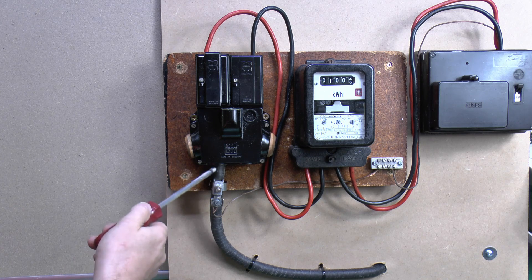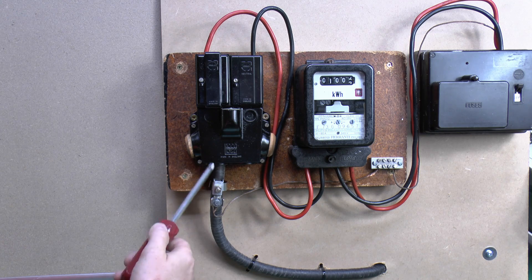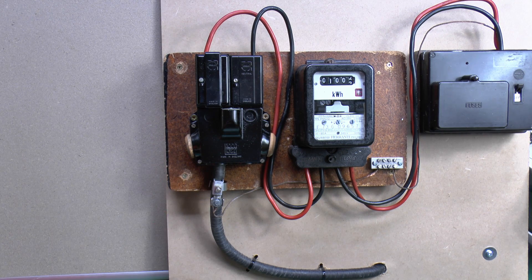So if you short out here, the fault current could be in the order of many hundreds of amps, but it's probably not going to blow the fuse, simply because the impedance of this simply isn't low enough to reliably operate a 400 or 800-amp fuse. What will happen is it will just burn from wherever the fault is, and continue burning and destroying the cable until either the fuse at the end does eventually fail, or someone goes and cuts off the supply to half of the street. By then you've caused a massive amount of fire and damage - even with say 500 amps, that's going to result in a heating effect of many tens of kilowatts. So basically this whole area will be completely destroyed, anyone in the vicinity is going to be severely injured, and basically half your house is going to be on fire. So any cables like this are never moved - that is absolutely unsafe and ridiculous.